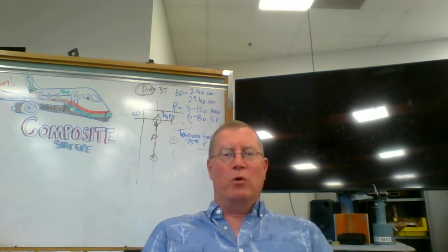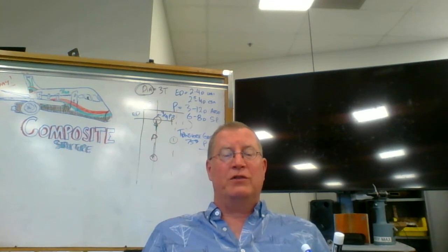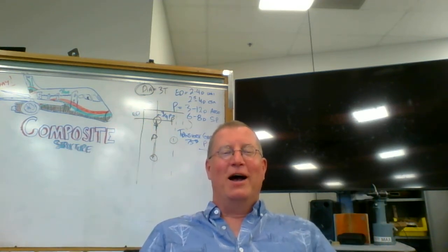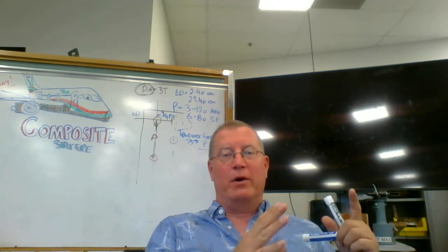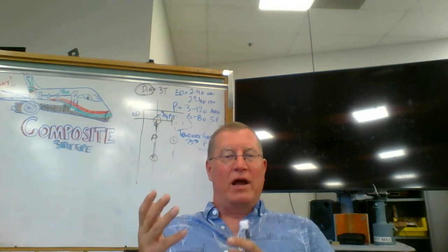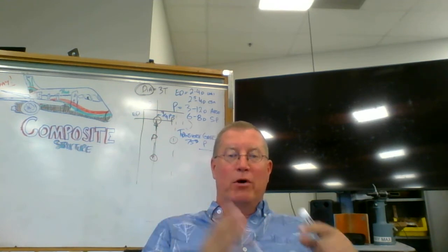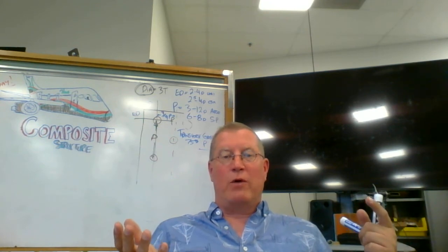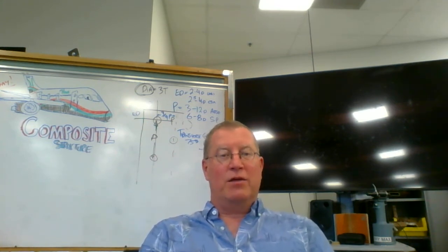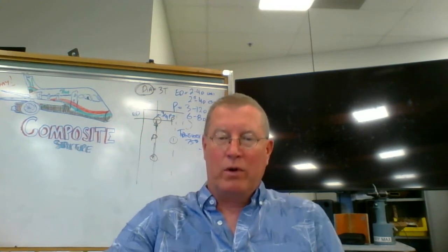NAS 523 code: they're going to give you the code in front of you and ask a bunch of questions. Understand what each of the different quadrants tells us. The top right-hand corner is going to give us base part number. The other top corner gives diameter. The big question is what's the N and F about - you need to know what that means. The bottom left-hand corner tells us what we're going to do to the skin. If it's a round or universal head rivet, there shouldn't be anything there. The bottom right-hand corner may give length or additional information - you've got to decode what's there.